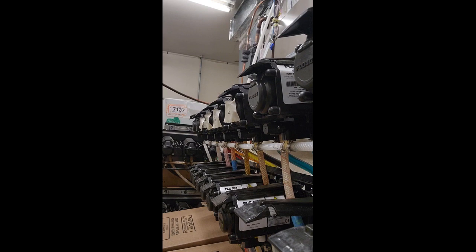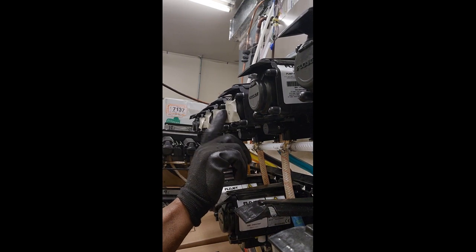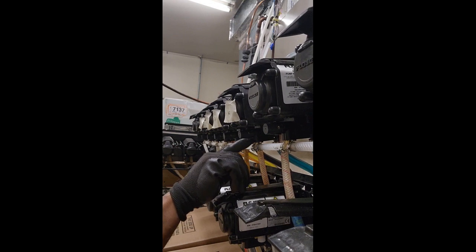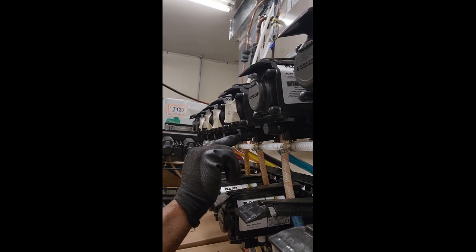I'm on a site that's having a carbonation issue with their soda and their Slurpee. I've identified the issue on these here. It's these pumps. Actually, it's these auto shutoffs that are on the pumps down below here.